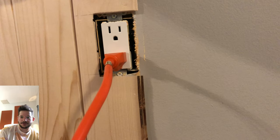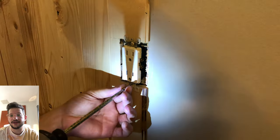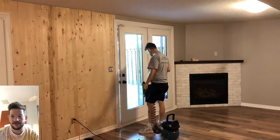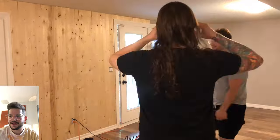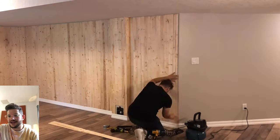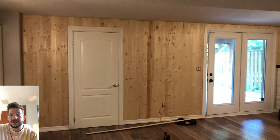Anywhere that I have an electrical outlet or switch, once I cut around it with the paneling, I just unscrew the outlet, pull it forward by that quarter inch, and screw it back into the box — keeps the outlet nice and stable. Then when we add our trim piece it's going to look professional and hide that exposed hole. Just getting above the door opening and continuing around the room, working around the big bulkhead with the table saw. At the very end piece I scribed on the back with a pencil, cut it on the table saw, and that piece meets up perfectly where the wall turns — that's where we decided to end the wood paneling for the live room. There you can see the whole live room is clad, and now we are ready for chapter two.